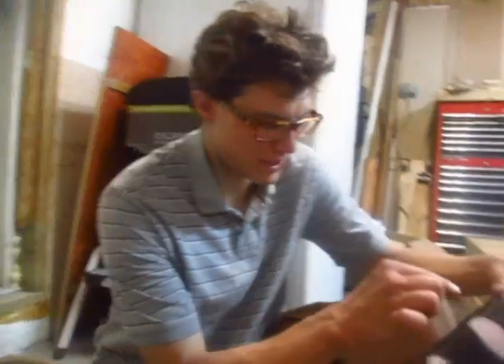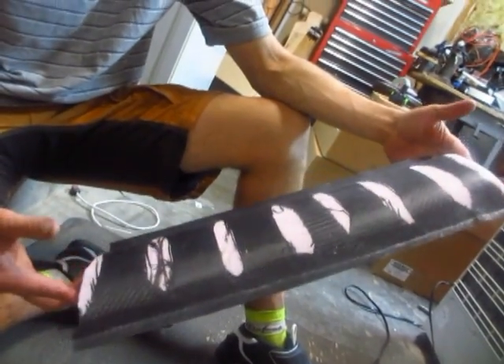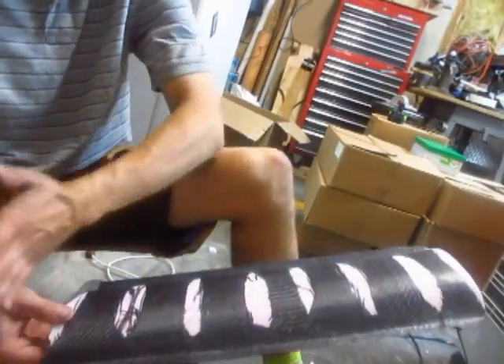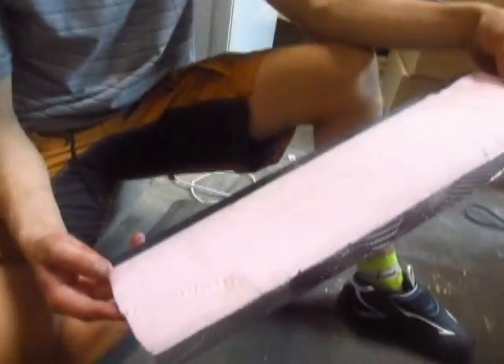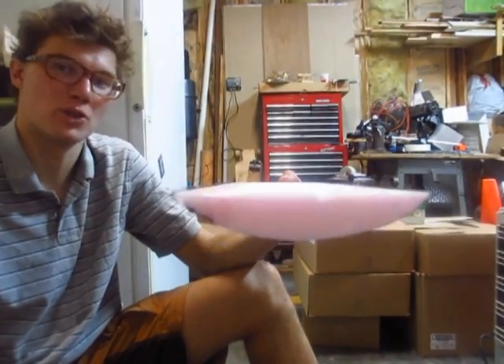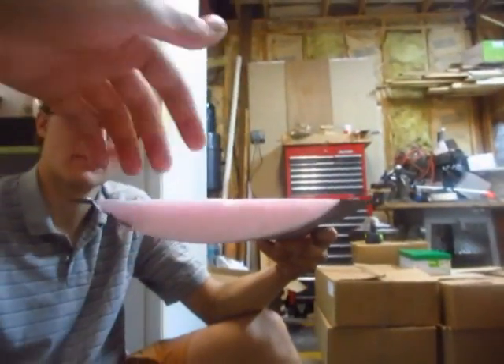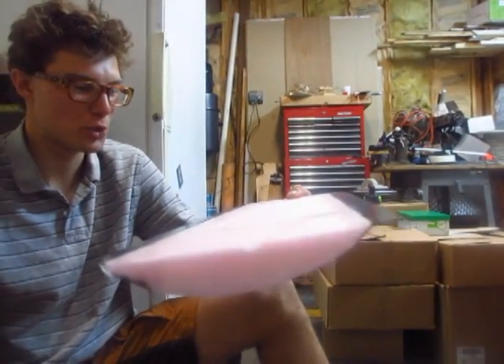The next step is to spend a little more time and decide which orientation of the fibers is promoting the best results, and also removing this flange to understand how much the curvature and the segments are providing. And also probably a fiberglass on the opposite side because it's not a complete box yet. We do the cross-grain fiberglass so it's able to stretch more easily. As it is right now, it is not a torsion box — it is partially a torsion box because it does have this surface from the foam, but this foam is totally outclassed by the carbon fiber. Two dissimilar materials.